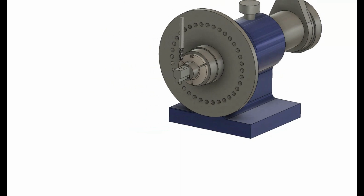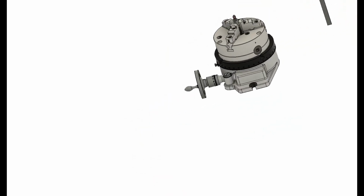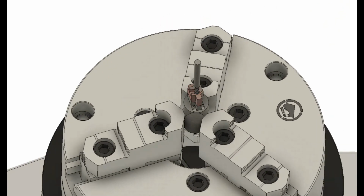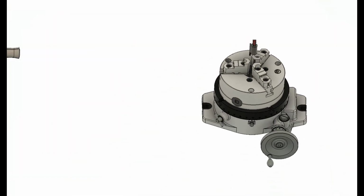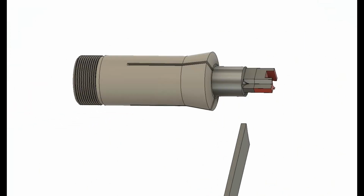For this particular part, I had to come down on the end of it with end mills, so I transferred the stock material into a rotary table to complete the machining operations. It's basically the same thing. The zero position is right in the center of the bar stock, and from that I was able to interpolate where the XYZ positions need to be for the milling cutter as it was proceeding.